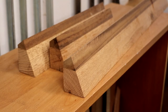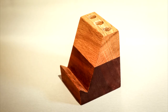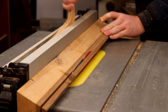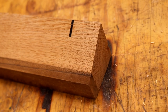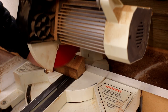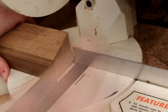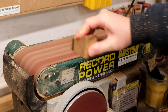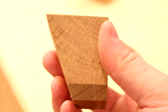While the glue was drying I started making some tapered legs for the houses. I had these offcuts from when I made the desk tidy smartphone stands in a recent video — I like to find uses for my offcuts so these were still in the workshop. All I needed to do was square up one side at the table saw, then I marked up how thick I wanted the legs to be, lined up my mitre saw blade with the mark, made a sharpie mark on the bed of the saw and then made consistent cuts to form each leg. After a little sanding they looked great — I really like the sapele dark wood accents at the bottom of each leg contrasting against the light oak colour.